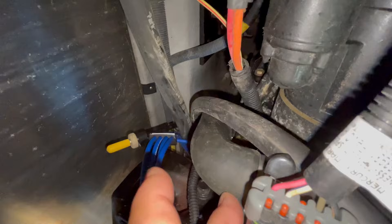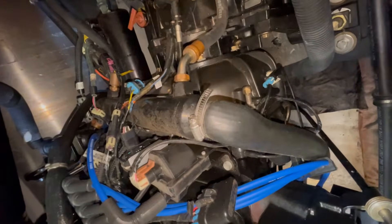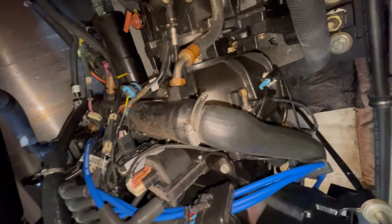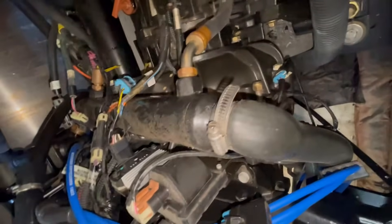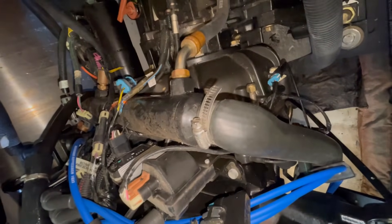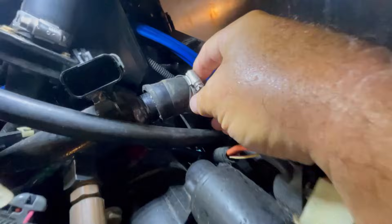The first place I want to check — I want to pull that hose off on the far end and make sure there's no debris right at this point. If you were going to suck up any debris that got past the strainer, or if it's an old impeller that may have broken off bits and pieces, it's most likely going to be stuck on the inlet side of this transmission cooler because it has small tubes that will not pass any large items. I'm going to hit it with a hose backwash and make sure we don't have anything clogging it up. I loosen this hose clamp.